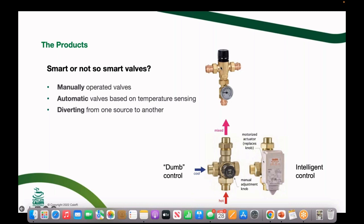There are pros and cons to every valve. If you want a little more control authority with that three-way valve, you could put an actuator or motor on it and take what we called a dumb valve and make it smarter — driving it from the boiler's onboard control or an aftermarket control. It can also be used for diverting: if you've got two heat sources — maybe a boiler and a heat pump, or a boiler and a solar array — this valve could make that selection for you.